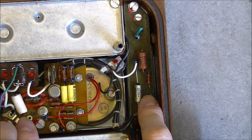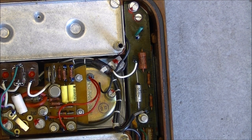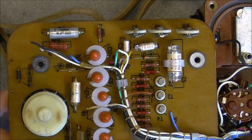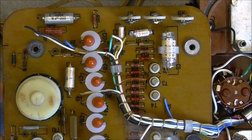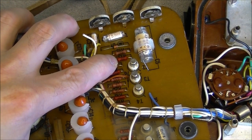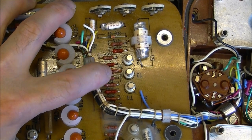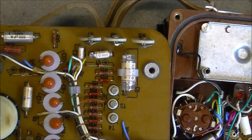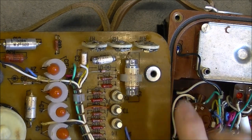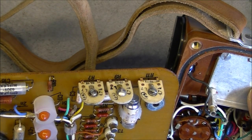And I guess here is the Geiger tube. This is the main board. The resistors look red, like regular Soviet resistors, but some of them have a Soviet factory logo while others are written in non-Cyrillic characters, yet have the K-number logo in a circle at the same time - interesting. The Styroflex capacitor here is made by Miflex, a Polyx brand. There is one more Styroflex and some very old school ceramic trimmers. Also some diodes in a wired package.